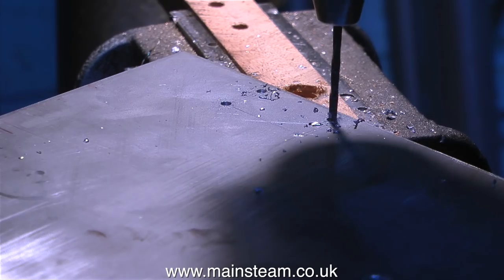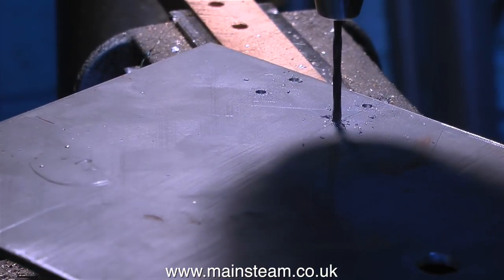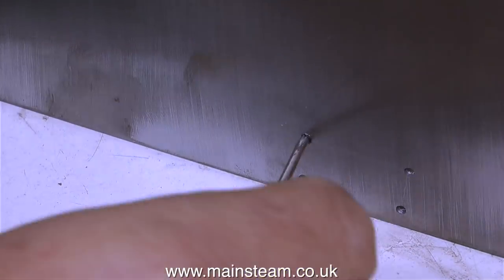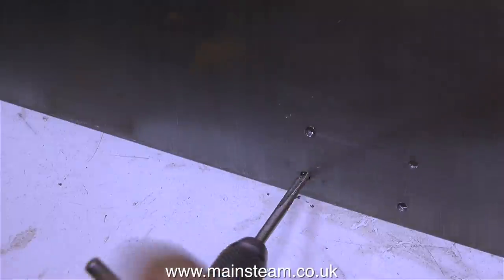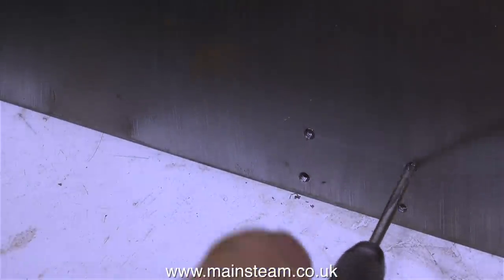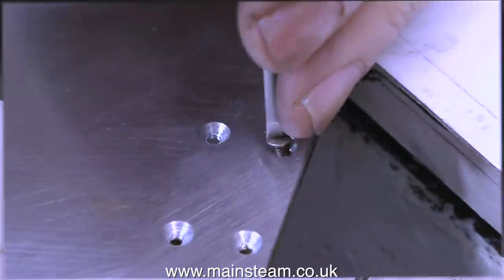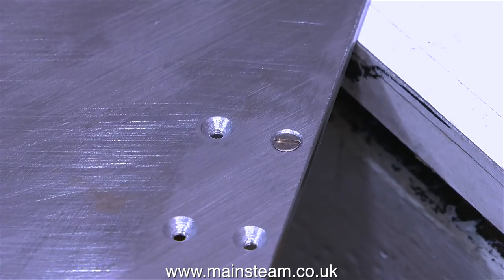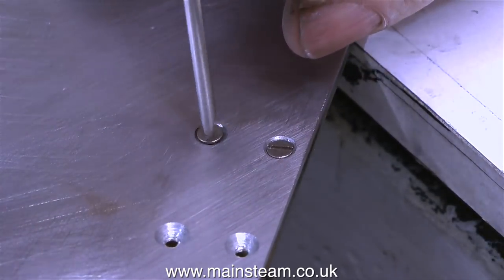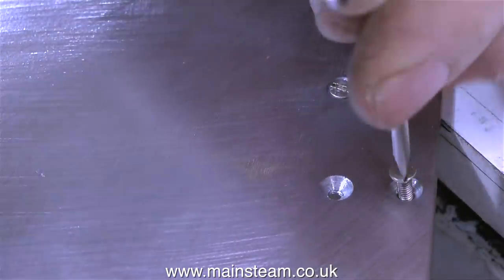This way I can go straight to the twist drill, but I do prefer using a centre drill. I'm using a number 48 drill, which is tapping size for 6BA, and I'm very carefully using a 6BA tap to cut the thread in the metal plate that sits on the baseboard. After threading the holes, I countersunk them underneath the metal plate. I should have countersunk these holes before threading them — so if you're doing a job like this: drill the holes, countersink them, then thread them. That is more logical.